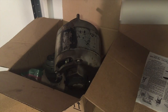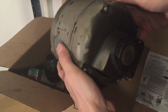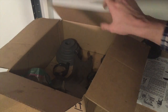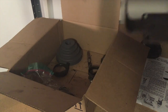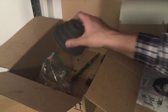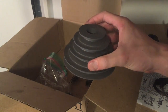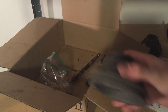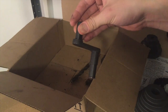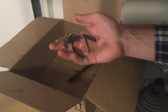This is a big box of parts that the guy gave with the machine. He had already taken the motor off because the mounts are really bad, so I'm going to have to work on figuring out the mounts. I've got the pulley for the motor, the mounting bracket for the motor, and the bad motor mounts. He was going to put in a counter pulley to make it go down to even slower speeds, so he got this aftermarket pulley and I'm going to try to fit it on the machine. I'm going to try to use the original swing arm that's already on the machine, and there are just more brackets for it.